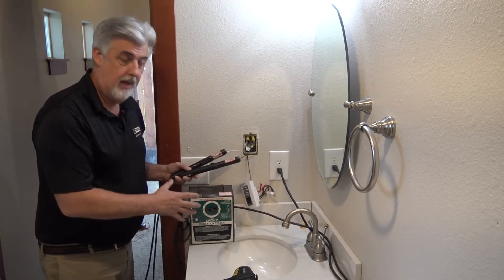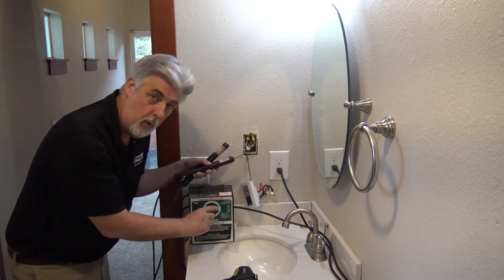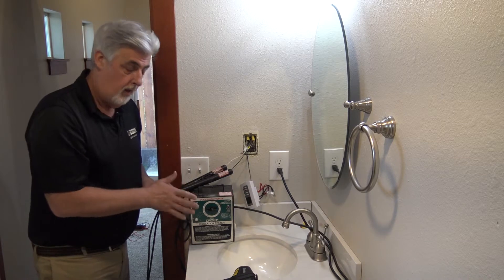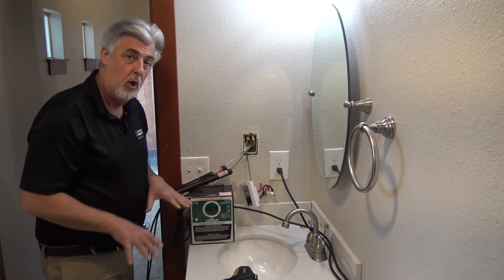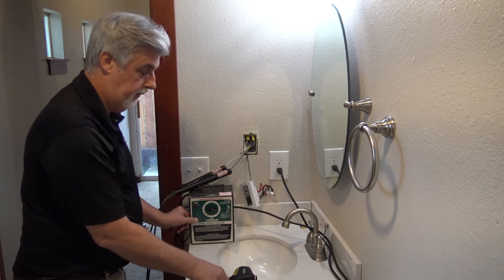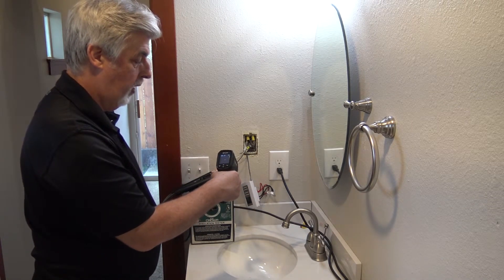Now I've applied a Hypot tester to the two leads. The two leads have the wires connected to them. This will go up to 2,500 volts. We have it set at about 1,250, and typically when it shorts out it'll trip the button. We're gonna try and find where it's arcing in the floor. As I flip it on and hold the button, it'll continue to run the high voltage through the floor, and then we will take the infrared gun and look across the floor for arcing and high temperature.